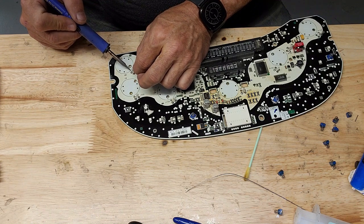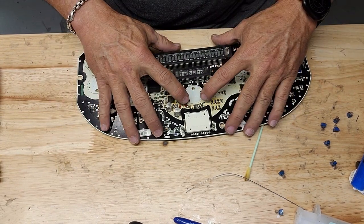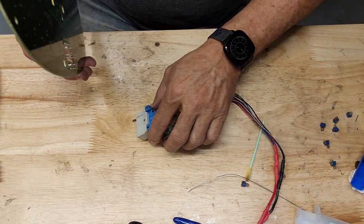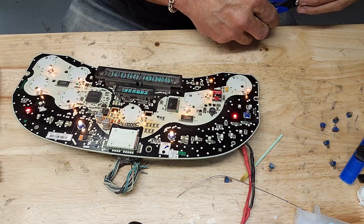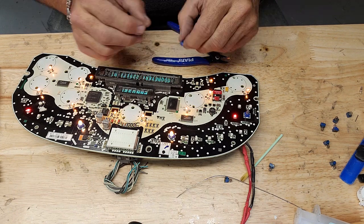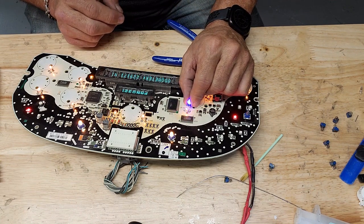If you're putting LEDs on instead of bulbs, polarity matters. So there is a positive and a negative lead on here. And you want to ascertain that with a multimeter. Or if you have a bench power supply, it's as easy as powering it up, taking an LED that's pre-cut also, with legs bent over, and you can touch your LED. If it comes on, it's right. If it doesn't, then that's the wrong polarity. Alright.